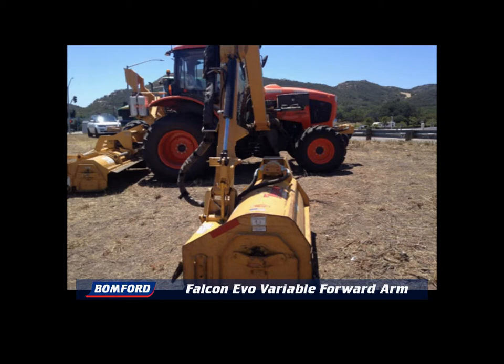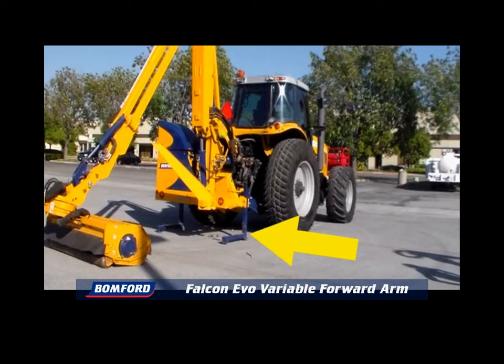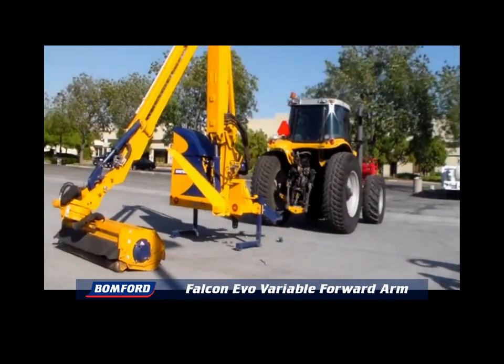Taking this mower on and off is so much easier than the traditional mid-mount mower. The blue parking stands you see are stowed on the mower. The tractor three-point drop arms are attached to a yoke. The yellow triangle on the tractor, which makes the third connection point, and the mower is now securely attached to the tractor. Note that the rocker shaft is in the lowest possible position to the mower, and it requires no hydraulic assistance to support it.